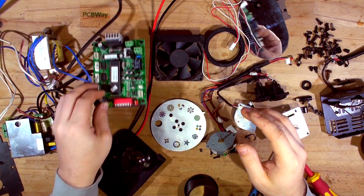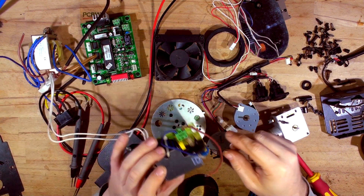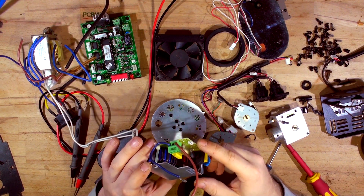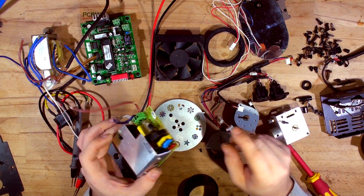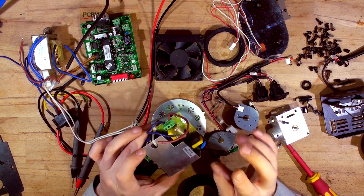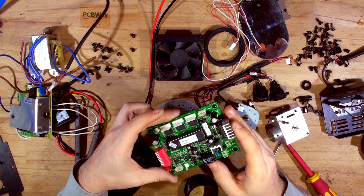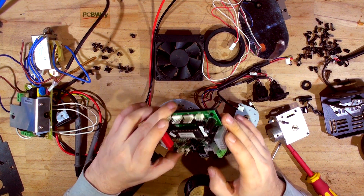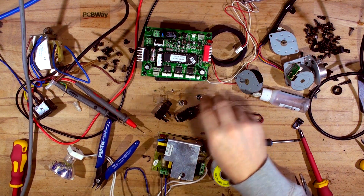Let's try powering up the lamp. I'll plug it directly through the current limiter and if it ignites we'll give it full power. I think the reason there was no power originally was because there was no load — the lamp was missing and no one ever replaced it. So we'll see if the lamp lights up driven directly by 240V; then we know the unit is working. If it still doesn't turn on it could be the relay, but I really doubt that.